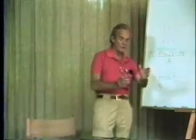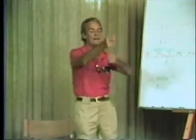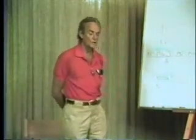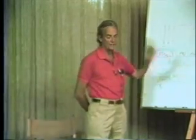Well, by taking different waves, yes, oh yes, indeed. But different waves are not called light. We call them ultraviolet light, or X-rays, for instance. X-rays are, in fact, exactly that. They're light, but with a shorter wavelength than normal light. Now, in principle, you could do, and people are trying to do, this kind of thing in which the X-rays affect the resist. You're absolutely right. They have to go through another technique. The photographic technique for making the pictures can't be silver and so forth, but you do it a different way. And there's a lot of work. And X-rays is, in fact, one way that is being worked on in various laboratories to reduce the size of this. Yes, that's a good idea.